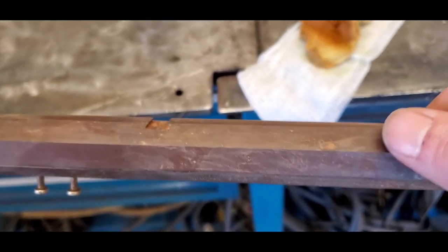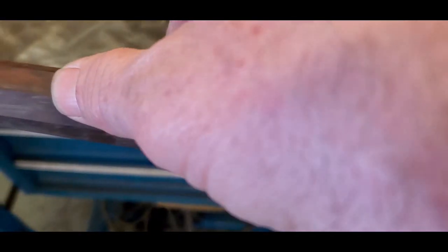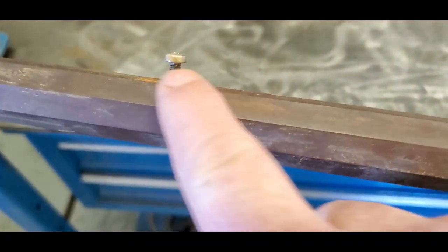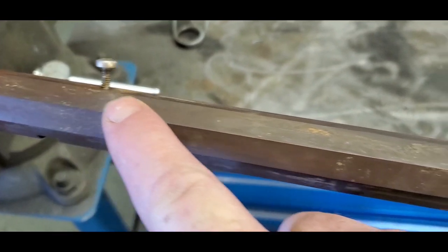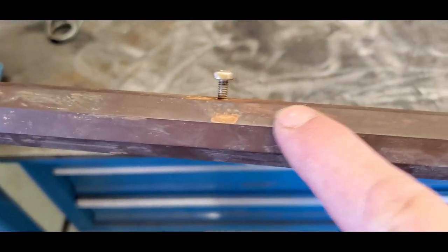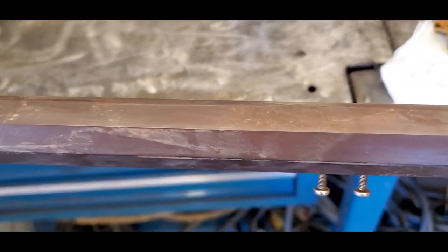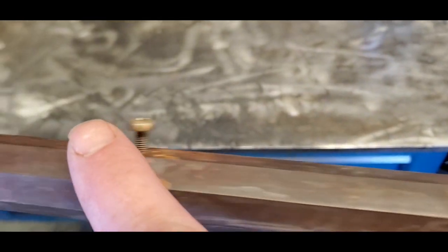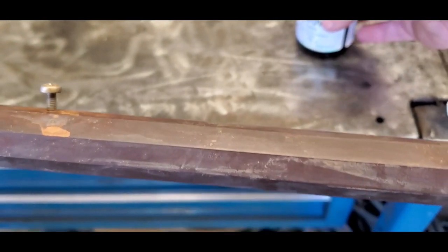It turned into a real nice brown — kind of that orange rust color. Now I have to pull it off and buff it out again, and I'm going to do a couple more coats of this. You guys saw how this worked — this is the old-school way of doing these old muzzle loaders. You could do this with the Plum Brown. Three Rivers will have the Plum Brown — this kit came from Three Rivers and they're going to carry the Plum Brown as well. Works really good. Just got to make sure you get your barrel warm.